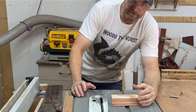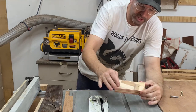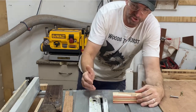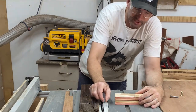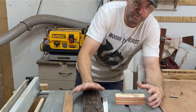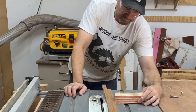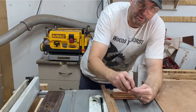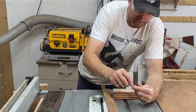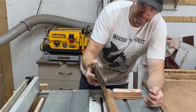So this video is not just me basically gluing small bits of timber to make this piece of art. What I want to throw in is making a little thin strip jig. What that lets you do is safely cut nice tiny pieces, or veneers if you will, off the side without getting any fingers near it. All I need to do is make myself a runner, a stop, a threaded insert and a bolt. I've just got to get a wing nut, which will let me lock off my position. So I'll quickly whip that up, and then I can start ripping all my pieces.